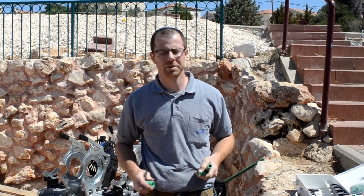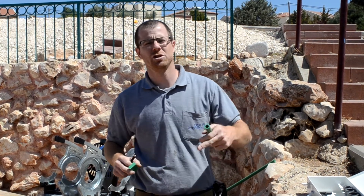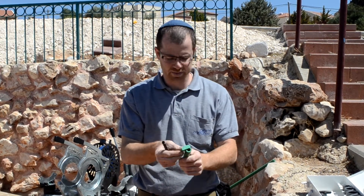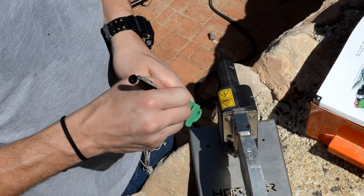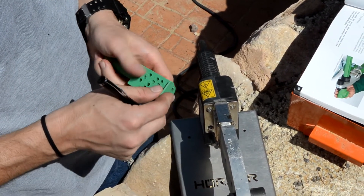The company imports it from Germany. Number one: you want to get the proper insertion depth. Insert it too much, you're going to close the opening, restrict the flow — bad news. So we have that gadget over there; we go by millimeters, so 20 millimeters — we make our mark in maybe two different places on the end of the pipe. That way I know when I start melting it, I don't go too far.